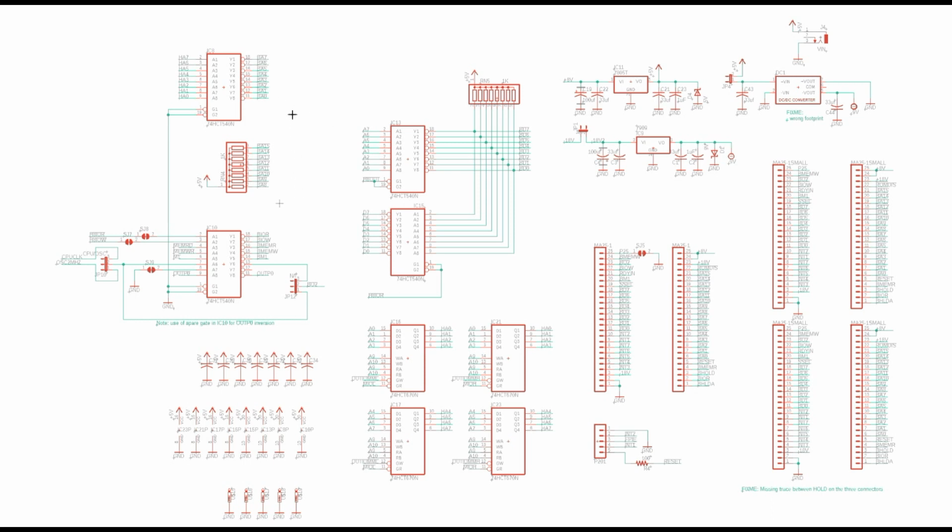I'm only doing the lower 8 address bits, so I made the decision with this board that I was not going to put memory out there on the H8 bus. I would only put I/O devices because there's just really no reason to put memory out there. We can put all the memory on the primary CPU board here. So that does the lower 8. The upper 8 address bits, I just hooked them to a pull up to 5 volts.